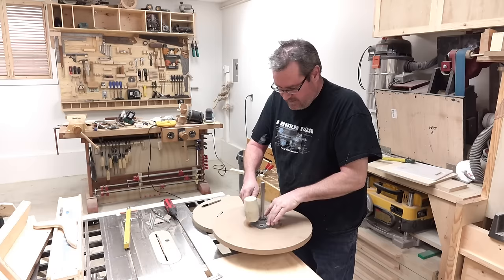So I'm going to use 3/8 threaded rod again to put those together. It's put together. See how it rolls. Works great. The idea behind the fixed casters is that you only want it to go straight, one direction back and forth. The swivel casters won't work here.